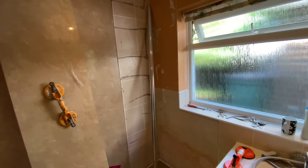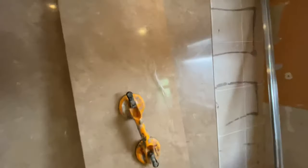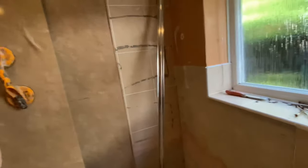Right, we are all full steam ahead now. I've got this one in — I always start with the back wall first. I could have done this one now but I'm going to get the back wall done. That one's all stuck. We're coming along now — two boards in here, done the back wall first, siliconed the edge before I put it in and cleaned it all off.